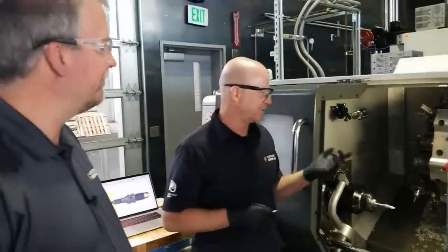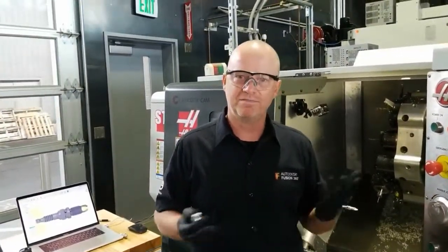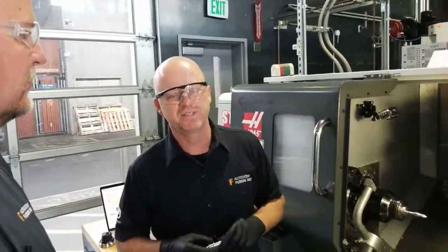Okay. And same thing with the lathe. You can take all of these tools and create them in Fusion, and you save it as your library. So here we have the Pier 9 lathe library. When I'm programming, I know what machines are available, and then you can add tools, you can remove tools. That's how we do it and how some people do it out in the industry. That makes sense. Pretty much the standard tools are in the turret, and then there's a 1/4 inch face mill and a threading tool, and the different kinds of tools you might use constantly. Yeah, common tools like facing and turning, and then threading, grooving, parting tools. So you'll have the most common tools in the machine.